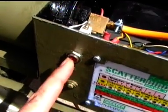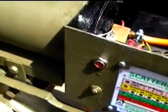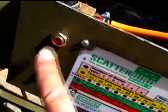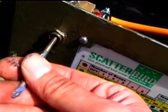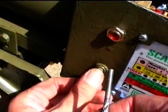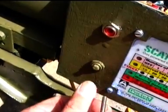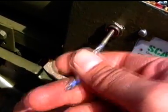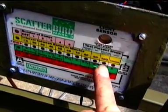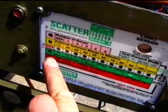I'm going to use that. I can't actually get at it with my finger, so I thought I can stick and glue the button into the end of that so that I can push it, or as a safety feature basically leave it like that so that when I want to use it I have to push a pen in to operate it. To do a test fire you actually hold button A and then push button B, and then it counts through the lights on the side — ten, nine, eight, seven — and then it fires.